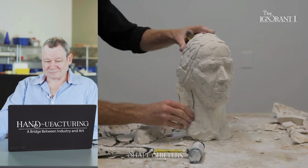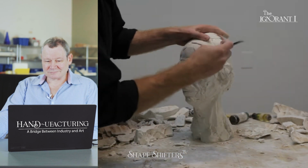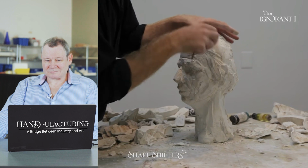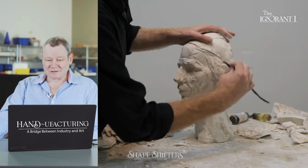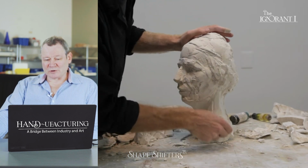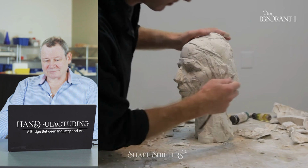Once all of the large pieces of the mold are removed, you may have to use a smaller tool to pull out some small pieces of the mold that are stuck. Again, if it were red, it would be really easy to tell. You also need to use a tool to remove the shim line, plaster that sticks up along the shim line. But he can patch this pretty easily.